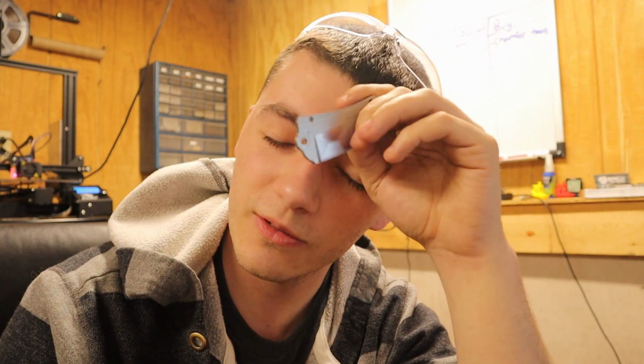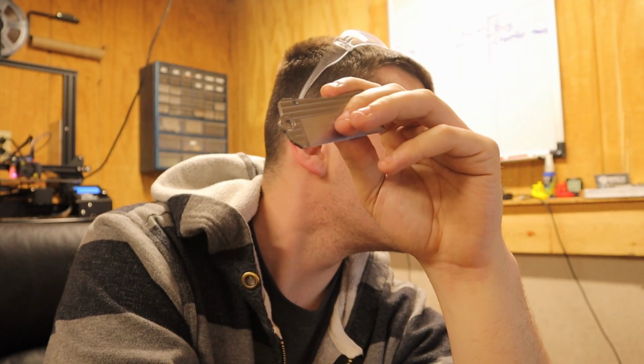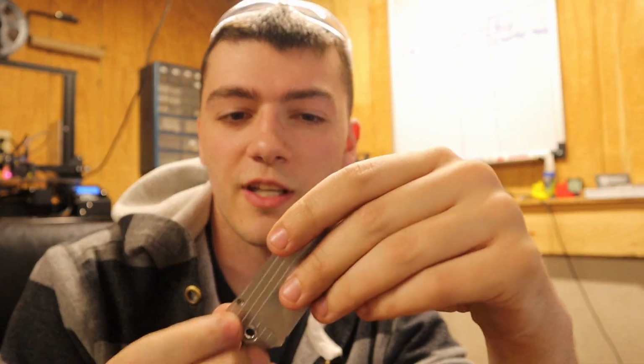And now that we've done all the toolpath work, we should be able to fly through another one. So I probably won't film that, but I will film the next part, which is making a handle fixture. So that's going to be pretty complicated, and cutting handles. So yeah, my plan for this thing is, what's the type of steel? S30V. Hold on, let me look. S30V. I knew it. See, that's what I meant. So S30V, which is the stainless, a pretty high quality stainless blade steel. And then we're going to do titanium handles because anodizing stuff is cool.